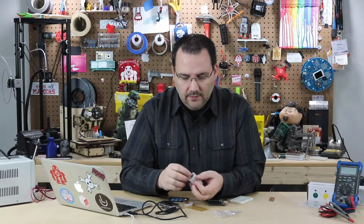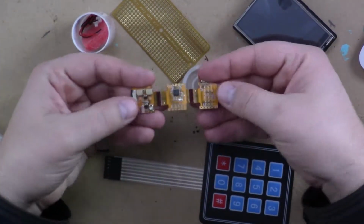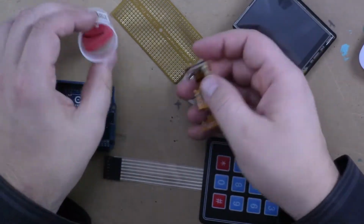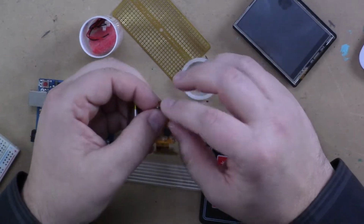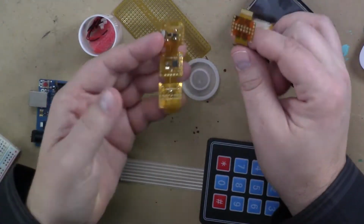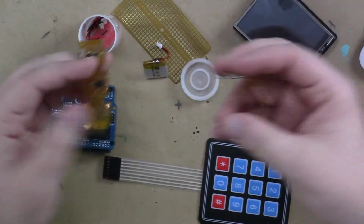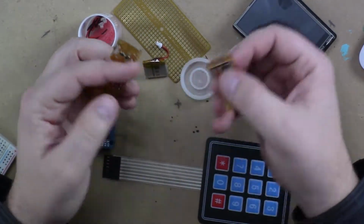They even have Arduino boards that are flexible. This is Arduino film. This is an Arduino compatible board, and you can see it's all done on a printed flexible PCB. Now there's some interesting things here. You need special batteries to power this. You'll need a special adapter to program it, but it's a full-fledged Arduino, and you can even get accessory boards with accelerometers on them and everything. And you can imagine, again, a watch or a bracelet where I could have this embedded inside some plastic or metal and really take on some interesting shapes.